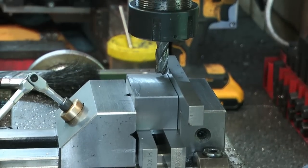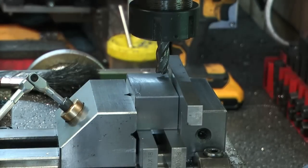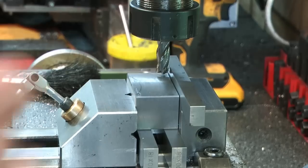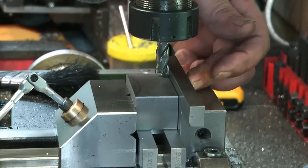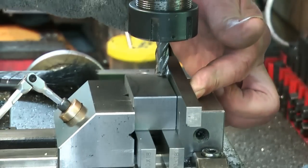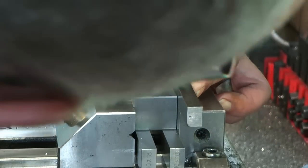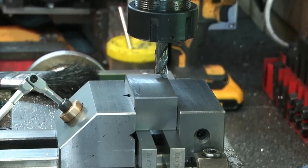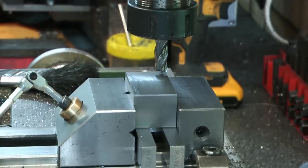Quick and dirty technique - rotate the cutter until you get a flute in line with the back face. I've got a parallel here, finger pressure. I'm too far off the edge of the block. Looking down at the daylight between the parallel and the block - there, that's the edge of the cutter on the edge of the block. Quick and dirty, nothing crucial here. I'm just going to set a zero there in Y.